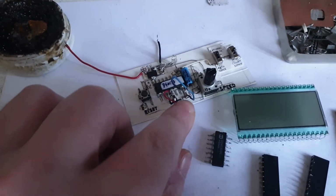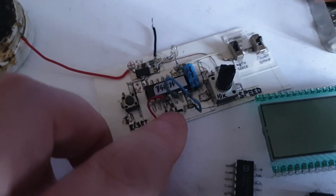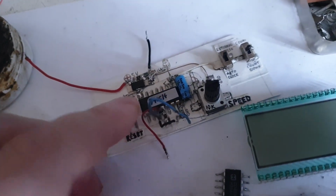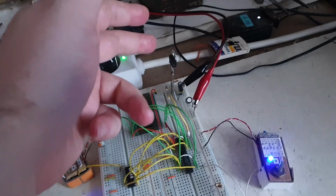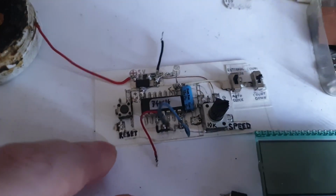So I changed that capacitor to a faster one. I changed the output directly from the pin, as you can see now. It actually has to be from this side, after the 10 kilo resistor that you can see, that small one there. I changed that resistor there. Actually, on this voltage regulator, I do get 3 volts, no problem. Probably that is certainly busted, this voltage regulator. I did test it quite a lot, and it probably gave up.